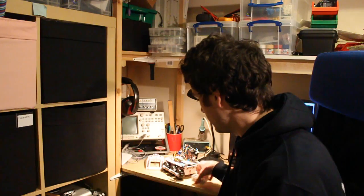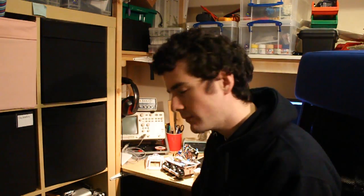Biggest problem I think with it is battery life. So drawing half an amp from double A's continuously, they don't last very long, especially not cheap, you know, BQ branded ones like I've been using. So it needs batteries changing quite often. It could probably do with some sort of brownout protection on it, so when they get down too low, you need to put up a warning.